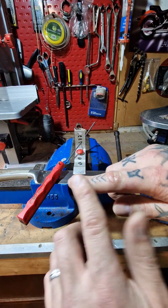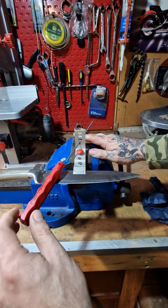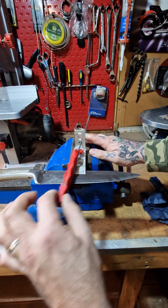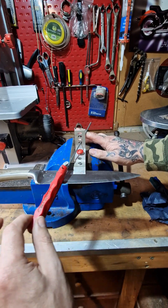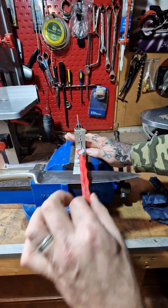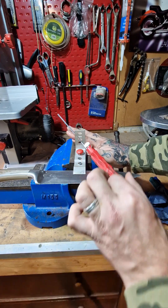What I like to do is get a little bit of the honing oil on my finger, gently support the back of this guide rod, and then you just literally, in a motion, pushing forward with not too much downwards pressure, start sharpening the edge. Take your time. You can work in a section at a time, but you just do this and work your way through all of your stones on both sides, gradually getting finer and finer.